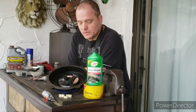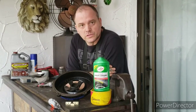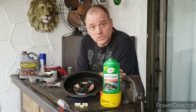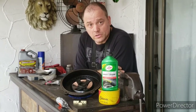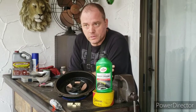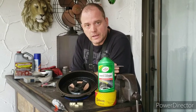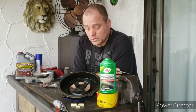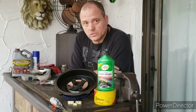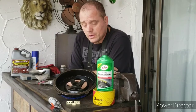Okay, so now I'm going to begin the process of cleaning up the finished surfaces on this Emerson. This Emerson was originally coated in a product known as Japanning. Japanning comes in a number of different recipes, but the primary ingredients are asphaltum, turpentine, and linseed oil. So it's really a beautiful and durable finish. It has a nice sheen to it. It's not too shiny, not too dull. So I want to preserve that.